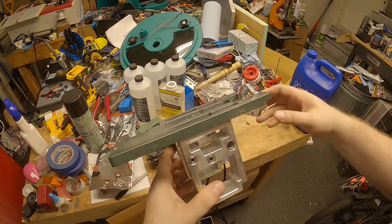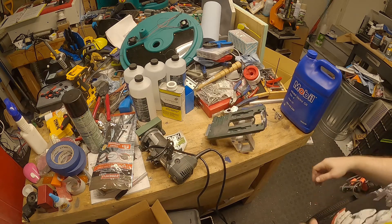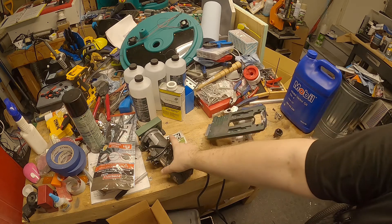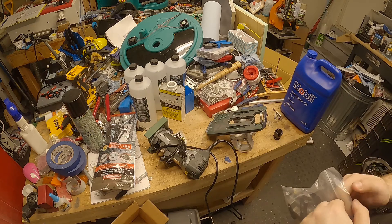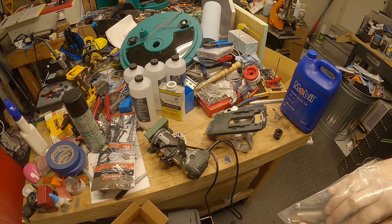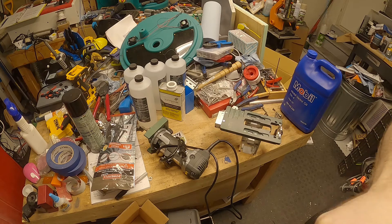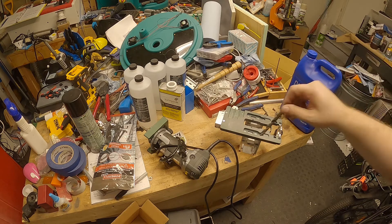With this part you lock it into place with the pin. This then screws into the back of the buffer tube extension, and then you start the hole with this part here. They provide all the drills as well. So if you buy this kit you just need a vise. This will attach here with two cap head screws, and there's a starter drill point for this drill — you just bore down until you get to that point.